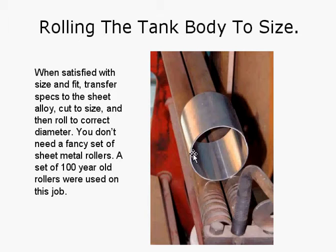That's not actually rolling yet — that's just sitting on the rollers. This is an old type of roller. Modern rollers have what's known as a slip roller, where you can pull one away from the body of the roller. This is an old fixed set roller, but as you can see it rolled a perfect circle.